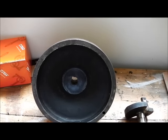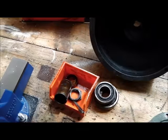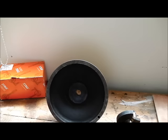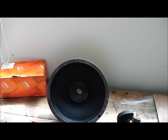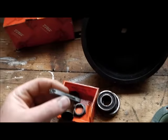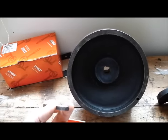That's probably going to be an outside job to repair, as it's a bit too big for my lathe which isn't a gap bed. The keyway is also going to need to be recut, so it's a bit of a specialist job. As you'll see in the next piece of film, the flywheel was removed using a 12-tonne press, which made light work of the job. That was with the key in place — having drilled it to weaken it, it was enough to remove it, though I drilled a little further than intended.